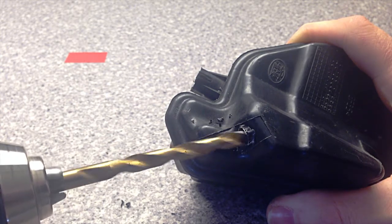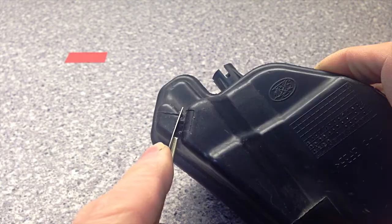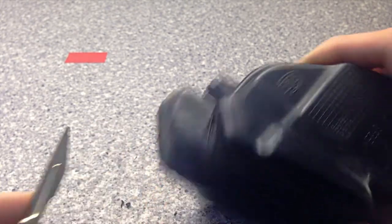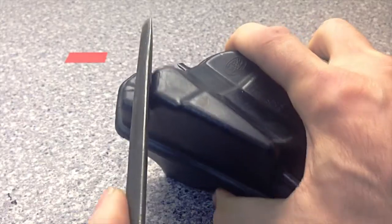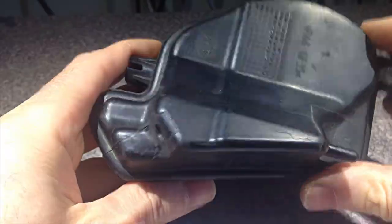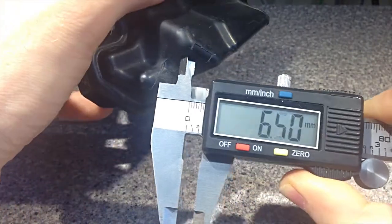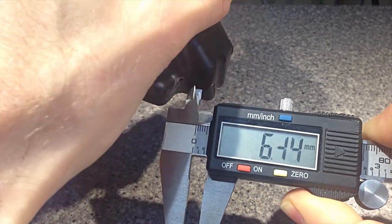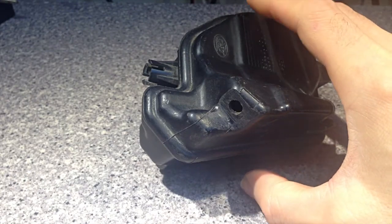So we're going to need some decent surfaces to work with. I'm drilling away all what's left of the existing nipple so that we get a nice flat base. Once we've got a nice clean hole of a known size in it, I'm cutting off any remaining parts of the nipple and going to clean the hole out a slight bit just to get rid of some burrs and file it flat for a decent mating face. We are going to make the actual new nipple a slightly bigger outside diameter so that it push-fits and seals up quite nicely.